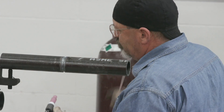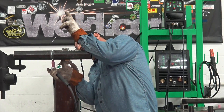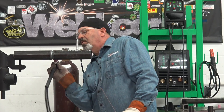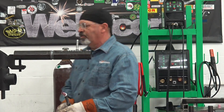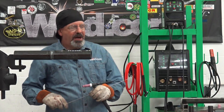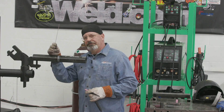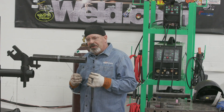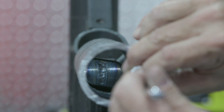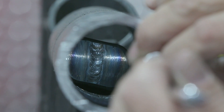If I was gonna do the other side, we'll just reverse that — switch hands to my right hand, come up here and introduce the filler wire, come up enough, rest the cup in there on the backside. Or if there's room, might just come back over and do it the same way again. Multiple methods — but some common things: the tungsten angle into the center of the pipe and the filler wire. We're trying to put a root in, so we need good melt where we're breaking the pipe walls down and getting that filler wire for reinforcement in the pipe. This is the portion of the root I did last — the rest of it's in there and broken down. This is where the repair started and I went on up to the top, just using a mirror and a flashlight to look inside for now.